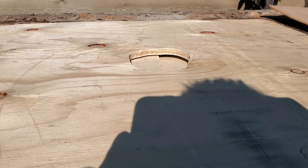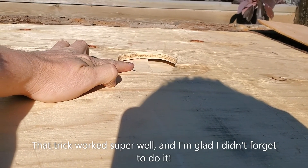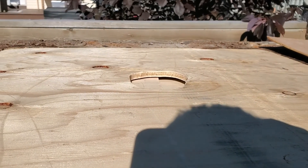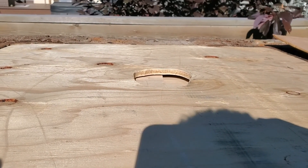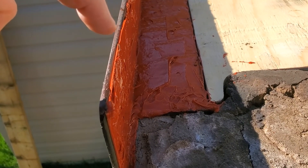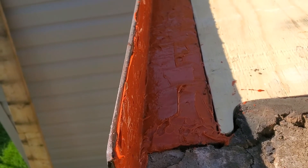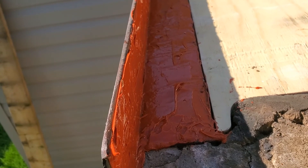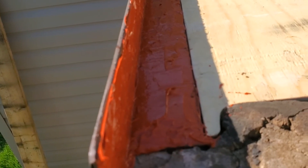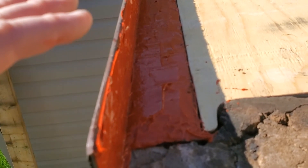After all, I decided to cut a little hole right here in the top plywood piece so that afterwards I can reach up with my fingers and hopefully pull it down easier, because it's going to have to come down into the smoker. The next step was figuring out a barrier between this angle iron and the concrete, so I'm just using some high-heat dap — just a layer of it — because if I put the concrete flush against it, it's going to wind up cracking off anyway.